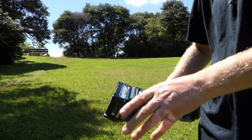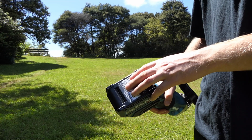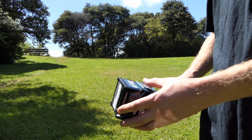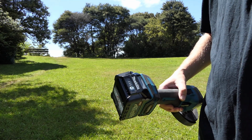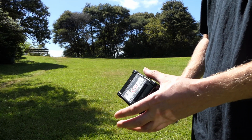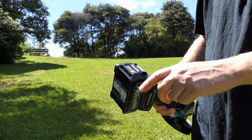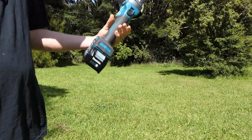If the new batteries were to fit on the old 18 volt tools, they wouldn't be able to use 21700 cell technology. They would have to stick with this compact battery, which uses 18650. With the larger 36 volt batteries, the currently available 4 amp hour and the soon to be available 5 amp hour use 21700 cells, which makes the battery wider, which wouldn't fit on so many of the old 18 volt tools. So why stifle the future tools just because of some of the old ones? Makes no sense. But I don't want to have to start a whole new system. Then don't buy it. Simple.